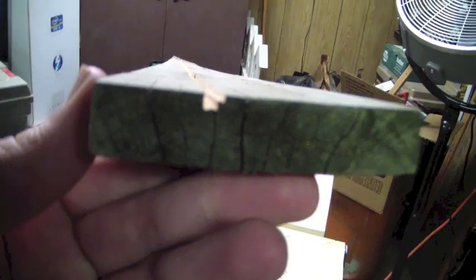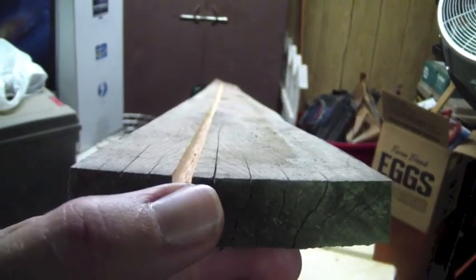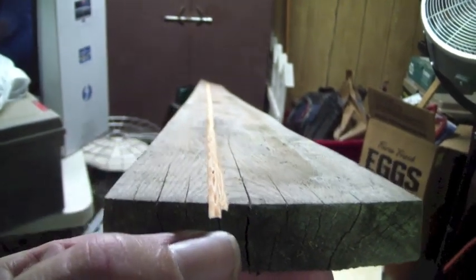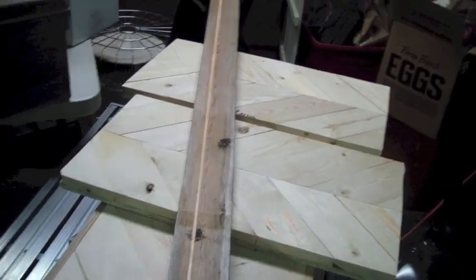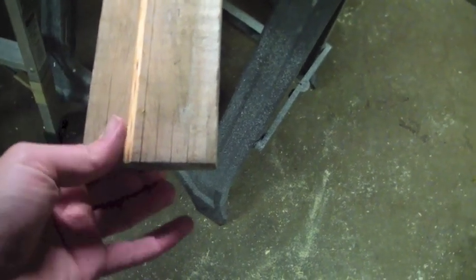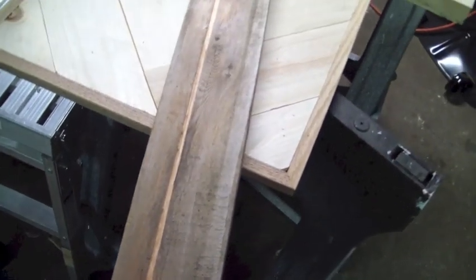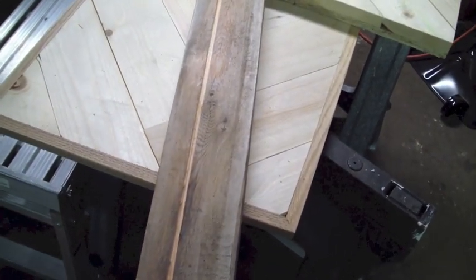It's not a real fun thing to do because as you're pushing the board through the table saw it's twisting and moving around a little bit. If I can show you here — that little step right there, at the tip of my thumb, is the difference in how far down it's pushing the board at the very end because of the warping. So I'll have to go back and recut that — I'll probably cut that end off since it's splitting out pretty good. I'll cut the board back to here and that will take care of some of that problem.